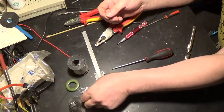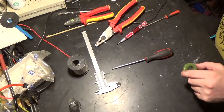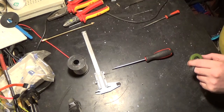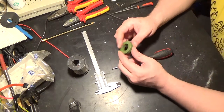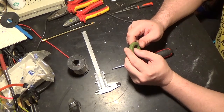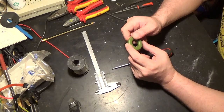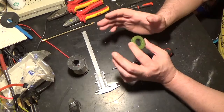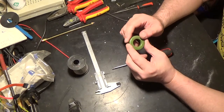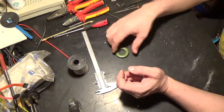Now we have to move on. These are the little screws that came with the case. Now we have to move on to, let's clear some workspace here. Little handy pin vise there, very easy to get your holes lined up accurately. In my case, unfortunately, I got them a little too accurate, so they were very tight and a little bit too precise. You kind of want a bit of tolerance. This is why it's important to deburr things, because those burrs, if you get them too accurate, set that 0.5 of a millimetre out, and that 0.5 of a millimetre can become an aggravation.